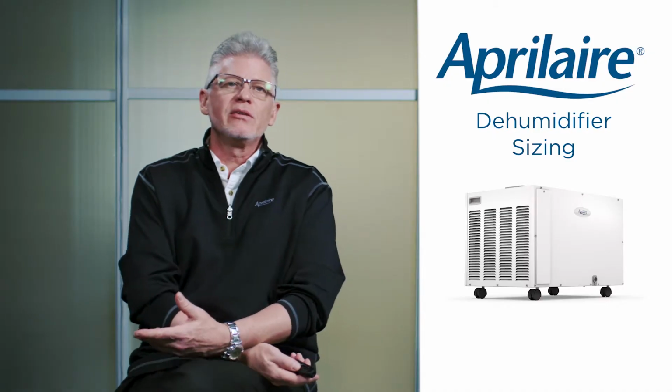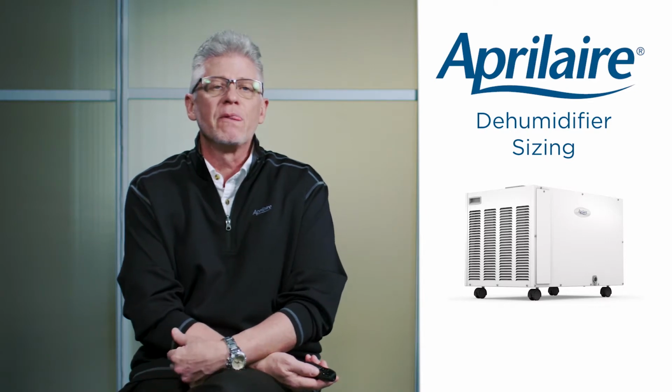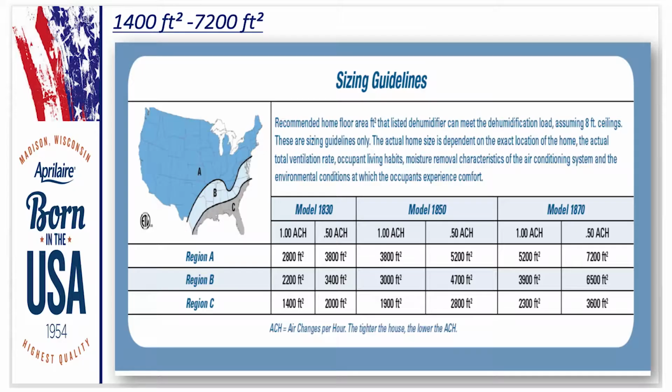So as far as sizing, this is a question a lot of guys ask us here at AprilAire. What size dehumidifier do I put in? Well, a real simple way to tell you is, A, you can't oversize a dehumidifier. It's impossible. Once it reaches a set point, it turns off. And really, the model 1830, 1850, and 1870 are the lion's share of all the products that we use in the United States, with the 1850 probably being the one that I would say 90% of contractors use. So you can see we can size anywhere from 2,800 square feet up to 7,200 square feet. This sizing guide is included with every installation manual with all of the dehumidifiers.